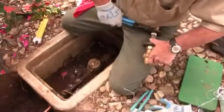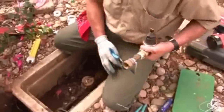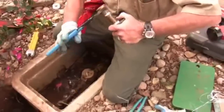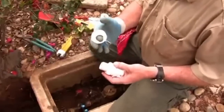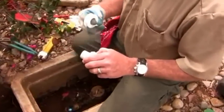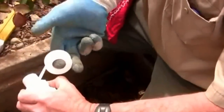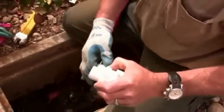The other end of the regulator is going to attach to that PVC line going to the house with a compression adapter — a PVC compression adapter, you'll see that in a second. There are a few things not shown in the editing of this video: one is when I cut the PVC I cone the end to deburr it. Here's an example of PVC pipe threads and Teflon tape going on in the correct direction — spinning the tape, wrapping it away from the direction that the nipple will turn into the fitting, keeping tension on the tape so it is forced into the grooves of the threads. I use my index finger and middle finger to restrict the turning of the tape roll. It's a learned skill. If you don't want to learn that, don't worry — just use paste. Use paste that's compatible with PVC and you're good to go.